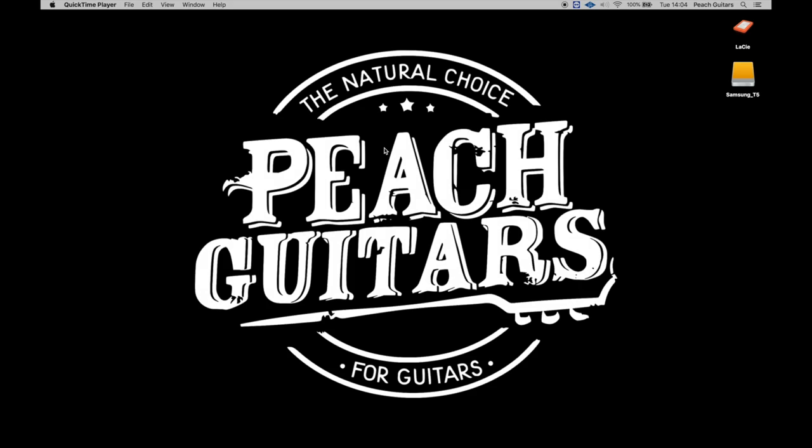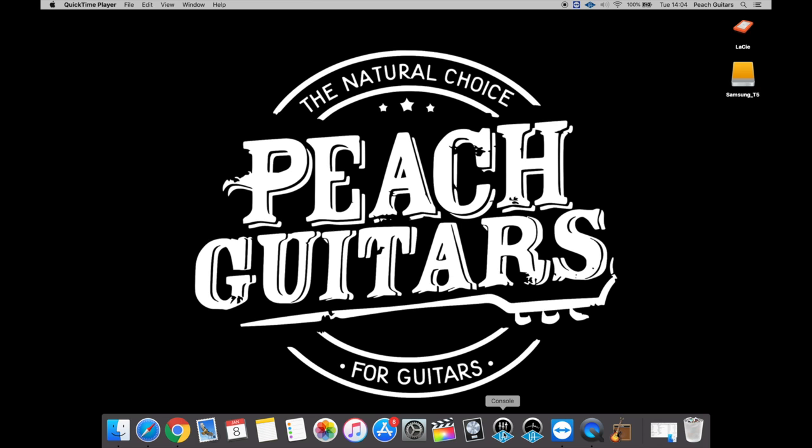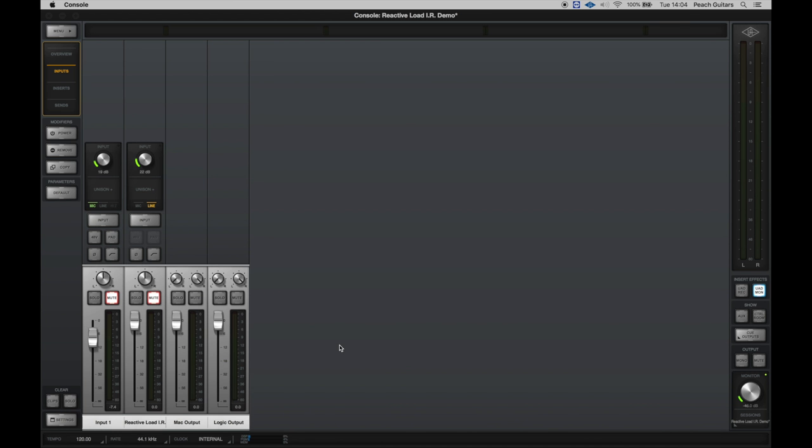All right, guys, so we're on the other end of things now. I've connected the Reactive Load IR to my computer here, which is a MacBook Pro, and I'm going to show you how easy it is to do that. So what I've done is taken the signal straight out of the back of the Reactive Load IR using a TRS balanced jack cable, and that's plugged into our recording interface, which in this case is a Universal Audio Apollo Twin. So I'm going to open up Console, which is the interface for the computer, so we can see exactly what's going on on the recording interface.